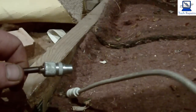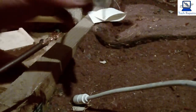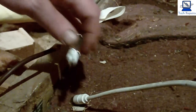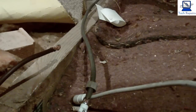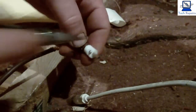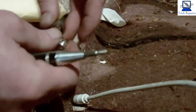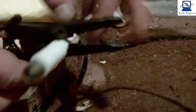The first thing we do is take the ends off the coaxial cable. These ends just unscrew off and then just pull off. Same again with this one, it just unscrews. The only difference with this one is it's got a little Phillips screw holding it on, so I'll just grab a screwdriver to take that off. That's two of them off now. This one we'll just chop off the end because it's not a screw type, it's a moulded type on the end.